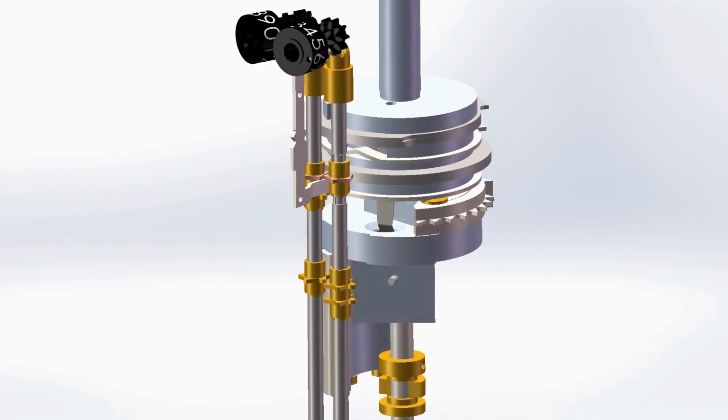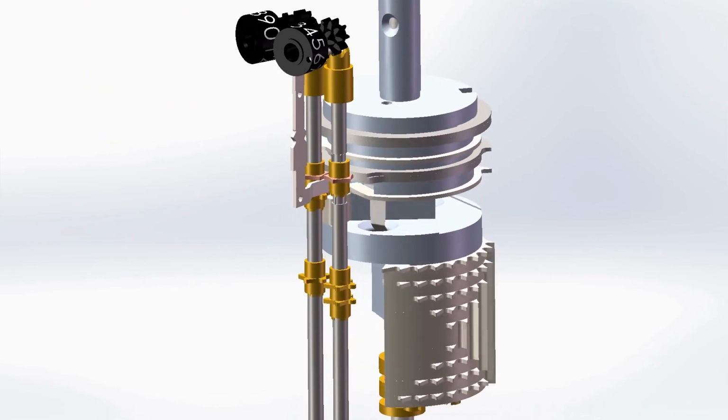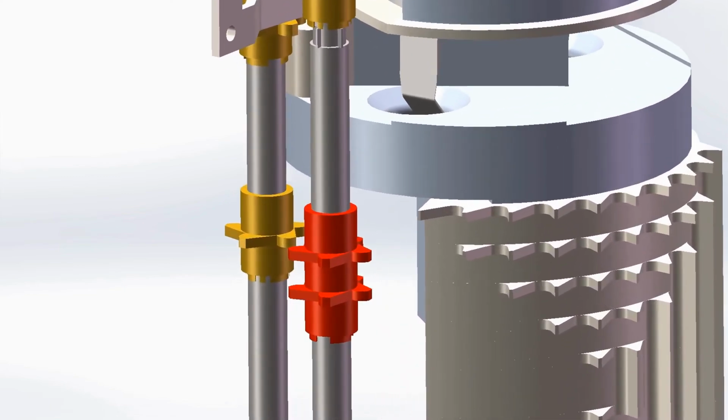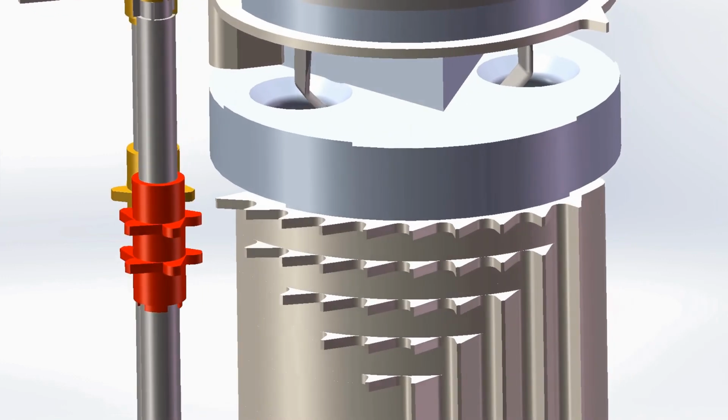Because 9 is added to every leading 0 digit on the dial, the carried 1 causes each 9 to roll over to a 0, carrying the 1 forward until it reaches the end of the carry system and is removed from the result because it can be carried no further. This effectively removes the carried 1. To add it back to the first digit, the first digit count gear assembly differs from the other result count gear assemblies in that it has a second count gear positioned above the first. This meshes with the next highest subtraction step drum plate, adding an extra 1 to the numeral dial and completing the 9's complement subtraction algorithm. For the 0 position, a special 10-tooth step drum plate adds 10 to the first digit.